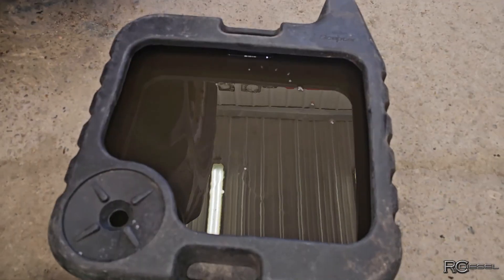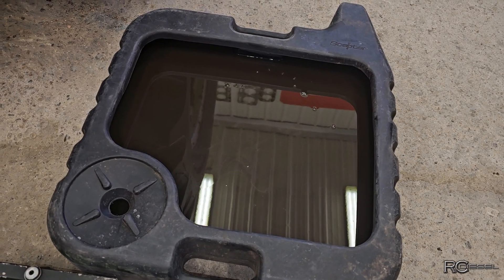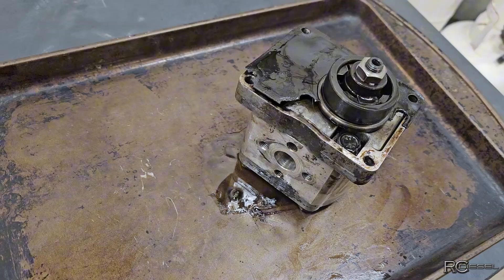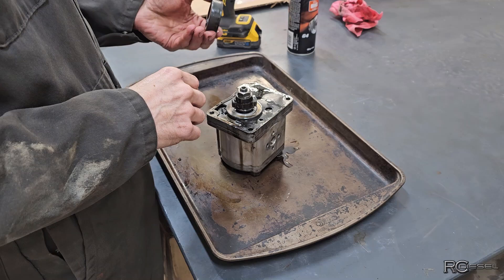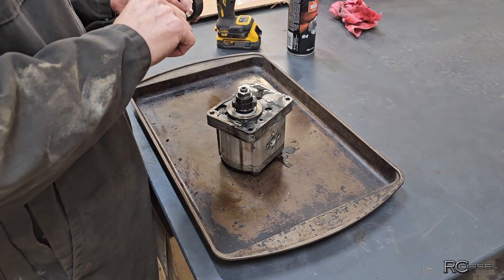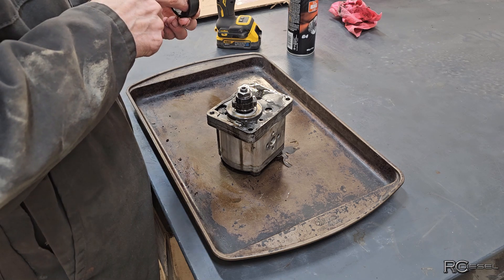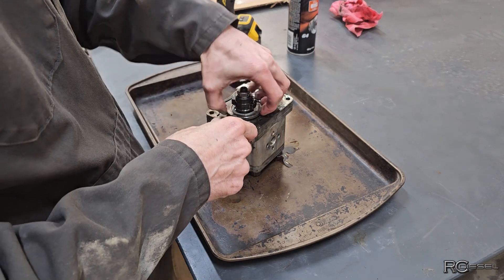So I drained the oil and right away you notice there's piles of aluminum in here. Watch this — see those rings? That oil is just full of aluminum. So we're going to have to put new oil in here, new filters, and get that pump off and put a new pump on. We got the pump out, we're going to pull this thing apart and see what's actually happened here. All right, so we got our drive coupler — quite a bit of wear in that coupler actually, and the thrust ring.